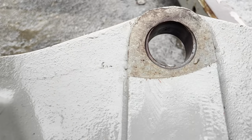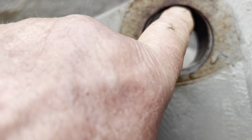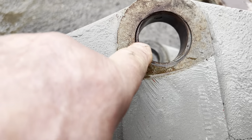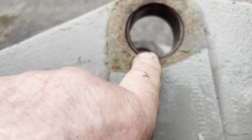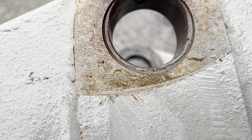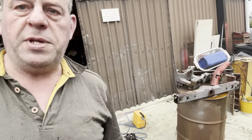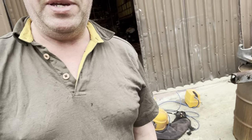That's cleaned up. You can see the play - that bush has worn through, hasn't gone all the way through. So we'll get a new bush - we'll do both of them, I think, because the front one looks okay but the back one there has definitely worn down to within its limit. It hasn't gone through to the casting. New ones needed. Now we've got these bits all stripped down, we'll get suited up and booted up and do our shot blasting job.